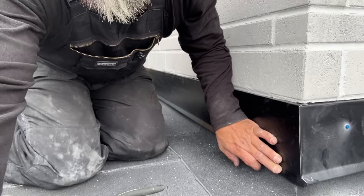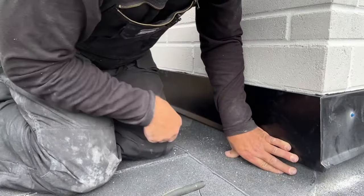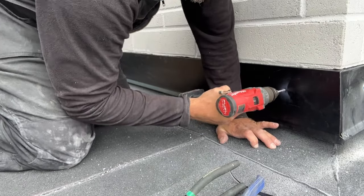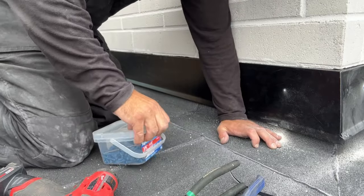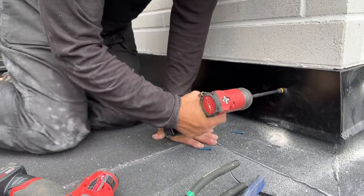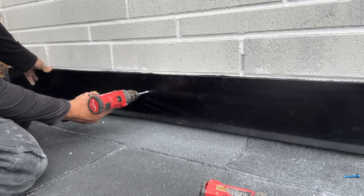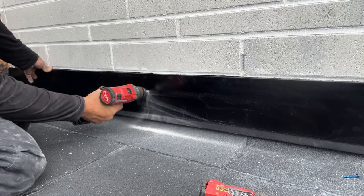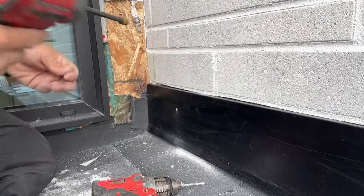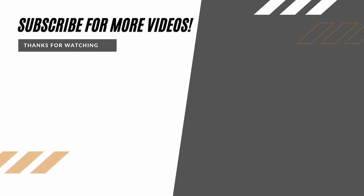You don't have to do that, it just keeps those sharp edges covered. If I pull it apart you can see this one's going to wrap around that one, and then once we get it in I'll just tap that with a hammer to keep it closed. We're going to put three screws in this side and then we're going to start caulking. Once again just a couple clicks with the ratchet, find center, same thing down about three inches. Metal done!